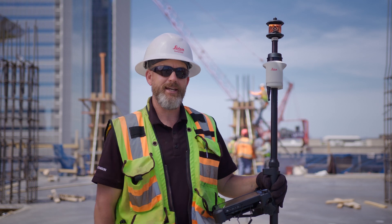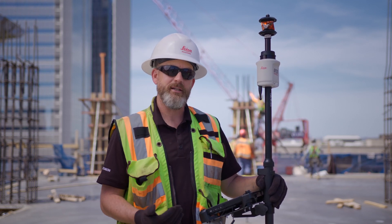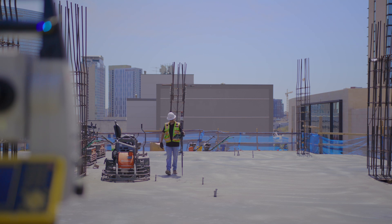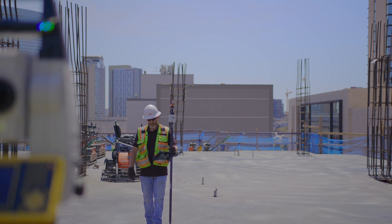While these guys went to lunch today, I was able to capture that. Everyone was off the deck so it kind of opened it up for me, and I was able to use my AP20 with a combination of auto logging as an as-built. When you do auto logging, it will store a point — you can define to store a point based off time. I set it up for about a half a second, and you can just cruise right through the slab.